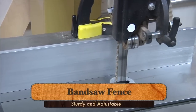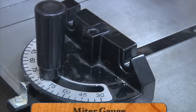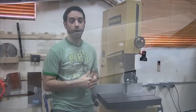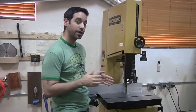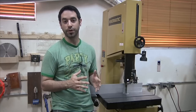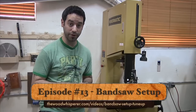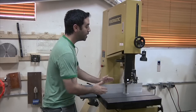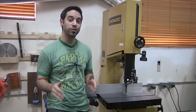To get this job done at the bandsaw, you're going to need a few basic things. Number one, a reliable fence. Number two, a miter gauge — it can just be the one that came with your bandsaw, doesn't have to be anything fancy. Number three, a stop block and a clamp. Make sure that your stop block has a little chamfer cut in the bottom corner, and that's going to allow dust to escape. The final piece of this puzzle is calibration. If the bandsaw is not calibrated properly, you should not expect good results with this technique. A tenon that is wedged or slightly off-center is just going to cause you problems, and if that shoulder isn't perfect all the way around, it's just going to be an eyesore. I highly encourage you to check out the bandsaw setup and tune-up video in the Wood Whisperer archives. Use that to make sure everything is perfectly calibrated, you've adjusted for the drift in your fence, and the blade is 90 degrees to the table.